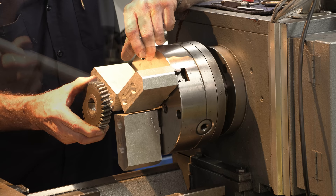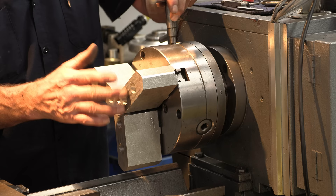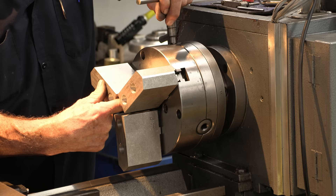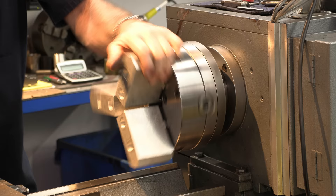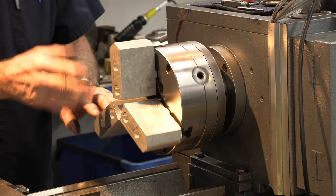I took a few bars — three-quarter was too small, it rattled around. I came up with this 7/8 rod, and all I did was lightly crack it open from where I estimated we wanted. We're going to be able to slip that in — I'm about that far in, plenty deep enough. I'm just going to tighten up. We're set up on the spider, meaning with pre-tension locking the jaws in the closing position. Now we're ready to machine.